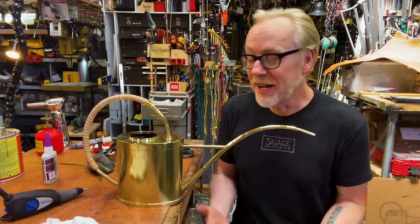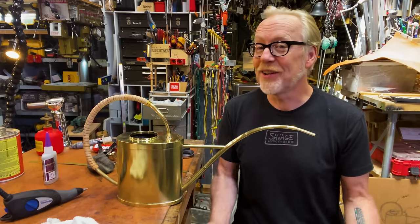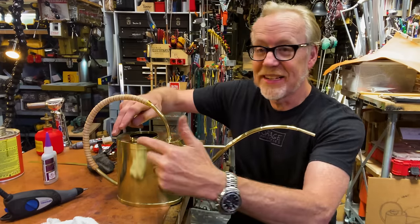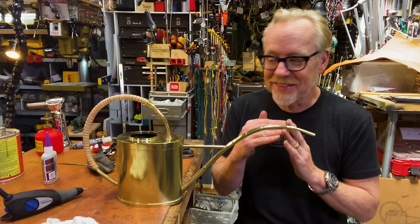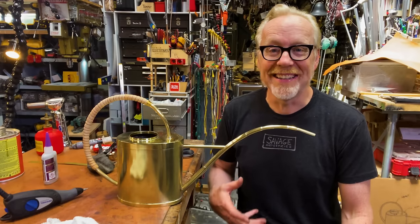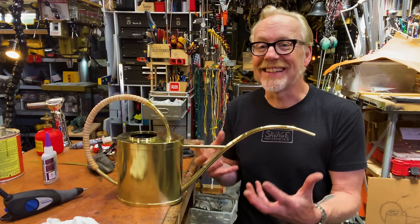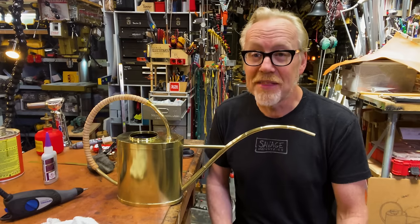And this is true. I have done a lot of brass manufacturing using silver solder, and there's still crap tons I am learning on the fly. Like, if you're going to have a structural join like the top of this, you really need to make sure it's supported with some surface area. And I didn't have enough surface area. That's one of the reasons I ended up chasing leaks on this thing, because the silver solder is not mechanically strong enough under certain circumstances using very thin brass.